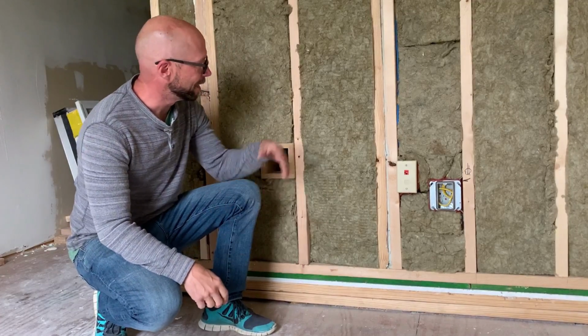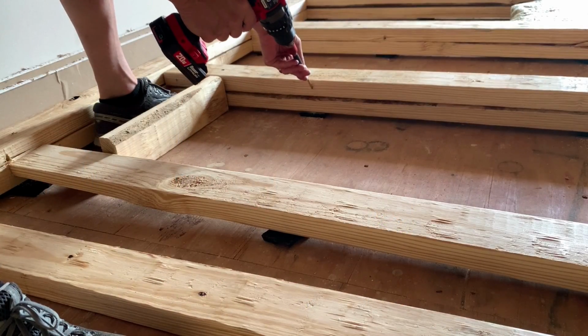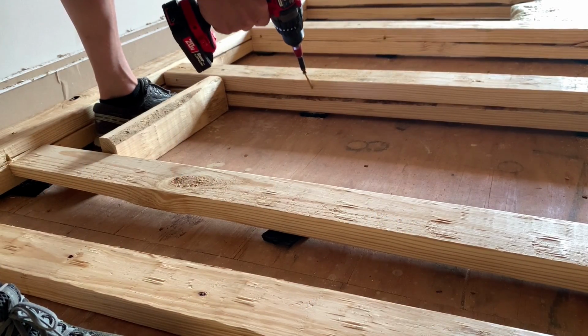Now, obviously the floor has to touch something. So this floor is very thick, very treated for sound with drywall, green glue, insulation, plywood, and Rockwool Safe and Sound insulation, and all of that is just resting on a few rubber pads to insulate the booth from vibrations that may come up from underneath.